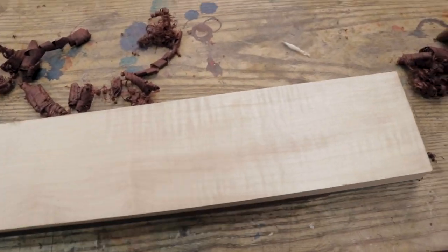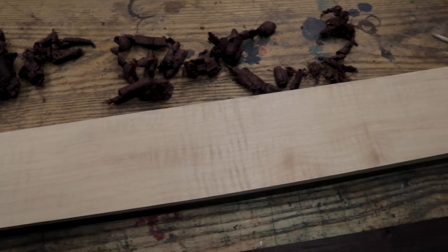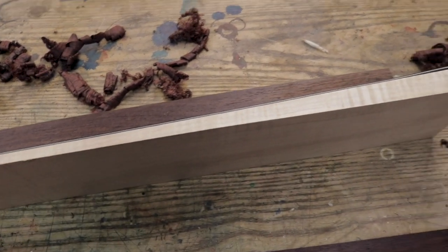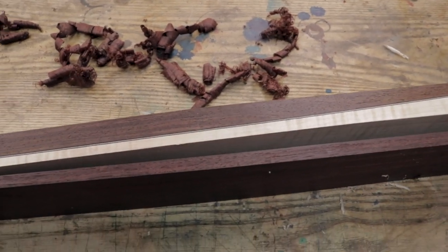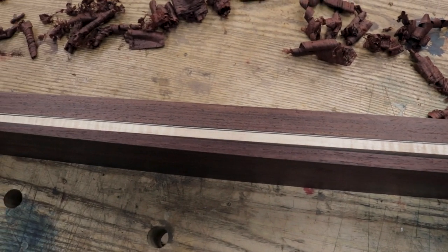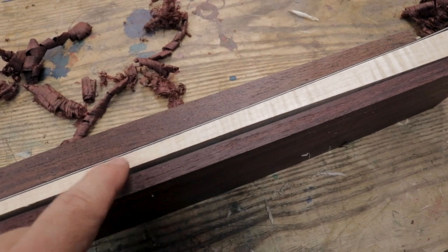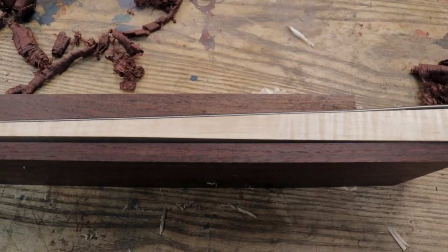Check this out. So not really a problem, but something to be aware of and is of interest. Now, I said I was going to plane this joint. And remember, we have already planed that. In the end, I had to use a scraper just to clean it up because there was some residue from the last gluing process, really. What we have, though, is because we've planed a curve into the other side, so the side with the multi-laminate veneer in it, this wood has decided to try and curve itself straight again, which is actually the exact reason why we're making a multi-laminate neck in the first place.